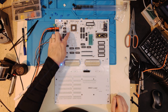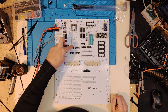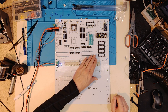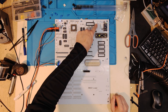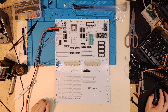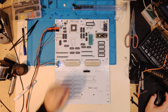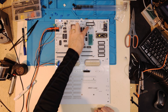The big things at this point are surface mount caps, surface mount resistors, and a surface mount LED. I do have some limited resistors that I put in through-holes - I just didn't update the footprints. And I have some larger caps that are through-hole, which were intentional. All of these resistors around here connect to the VIA and that's going to be SPI-type communication. I have pull-downs on all of my chip selects, and then some small 20-some ohm inline resistors. The processor signal resistors and decoupling capacitors are all placed around.